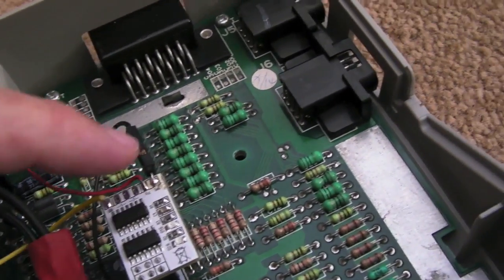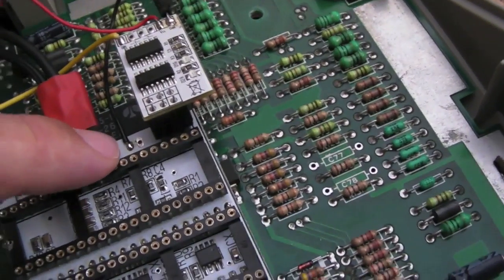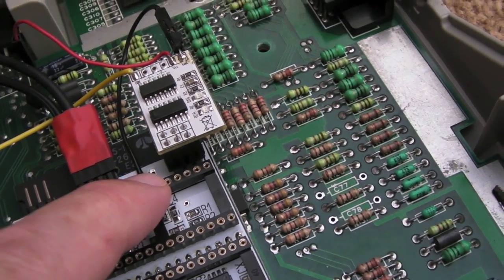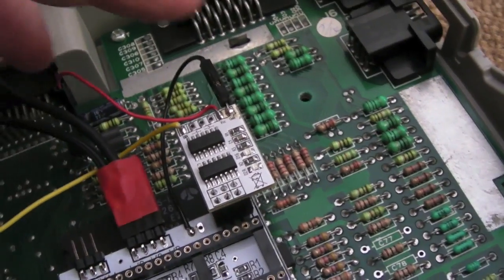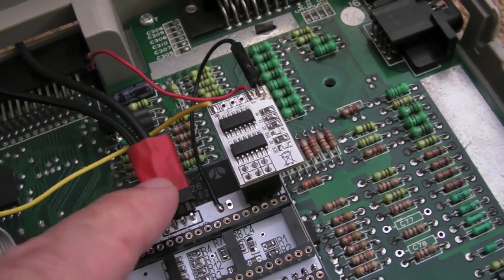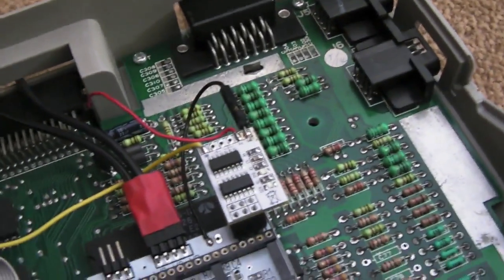And then I've done the inverse. I've put the actual pin header part for the ground on there and taken it from the board. I think that's for an LED position. Actually, you can have an LED on there that indicates whether it's in stereo or mono. I'm not bothered about the LED, so we use the ground for that, so those can't get mixed up. And then obviously we've got the 4-pin connector coming in here for the wires coming out the back, so I just need to get some leads on those, you know, not lead sockets.